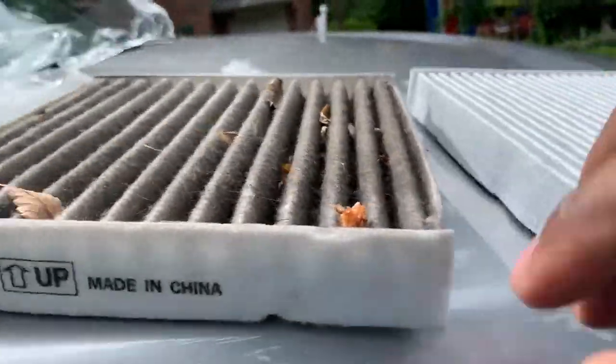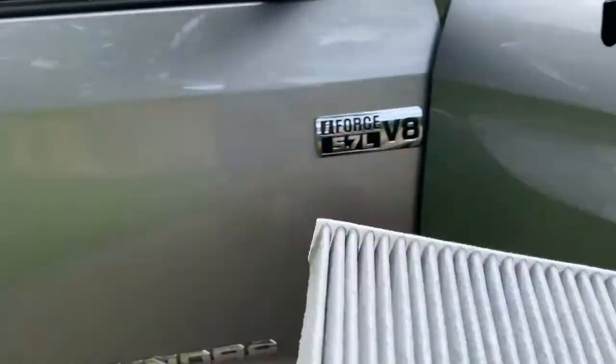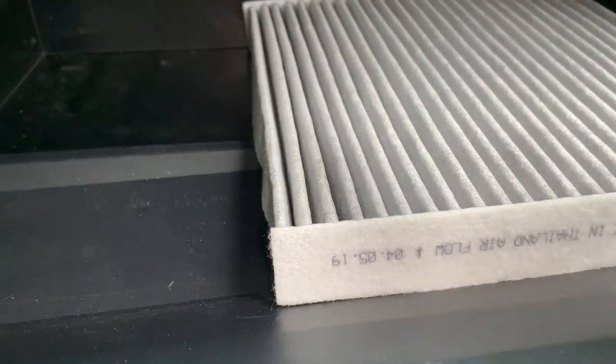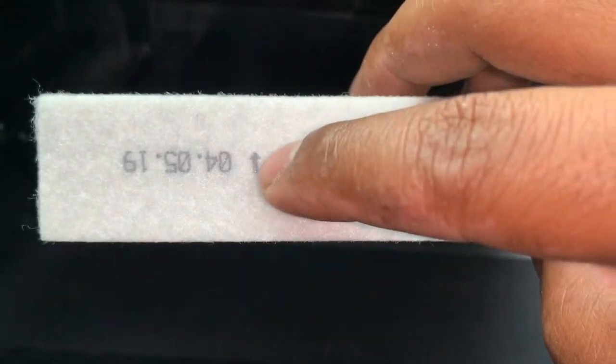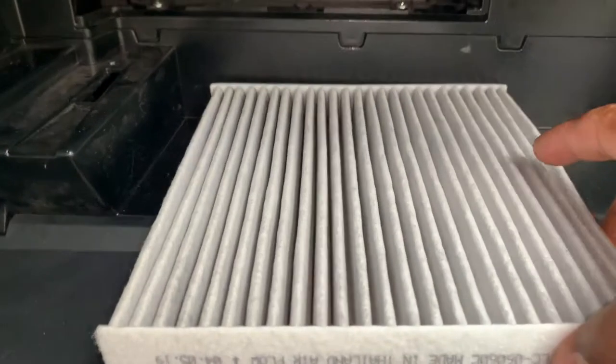This one says 'up', so since this arrow points up, we're going to point this arrow the same way. We're going in — as you can see, that's our blower motor, so it's definitely going to say airflow up since we have our blower motor here. You follow the arrow, which is pointed up. My old one — the arrow was also pointed up. So that is correct.